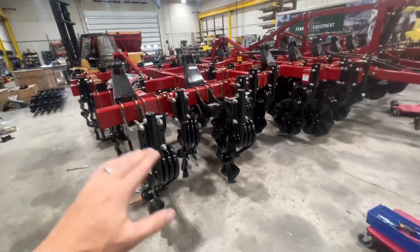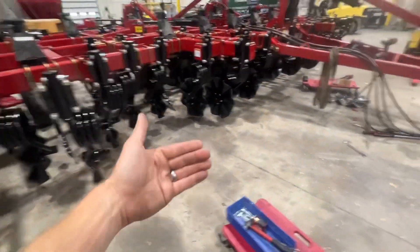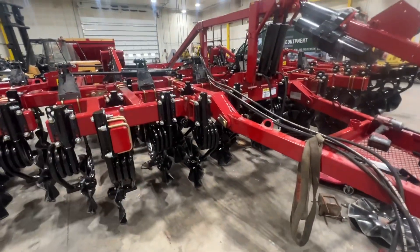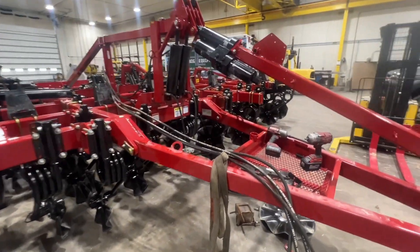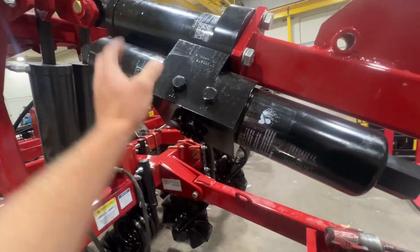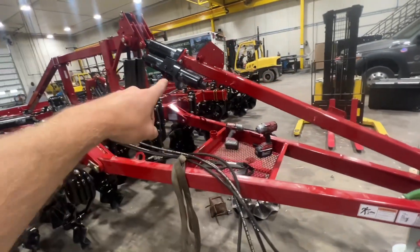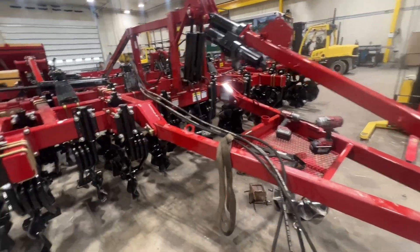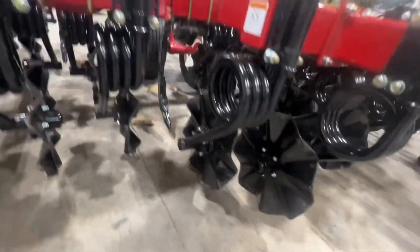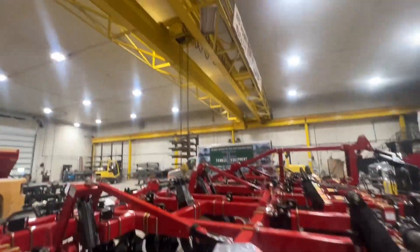What that point does going through the field is amazing. You don't have to run it all the time — you can hit your hydraulic lever and drop them whenever you want, maybe in a high-traffic area or a tight spot in the ground, then raise it up for the rest of the field. A sweet feature they're putting on a lot of these is the hydraulic fore-and-aft, so you don't have that hard-to-turn turnbuckle anymore — you can do it now with a hydraulic lever.